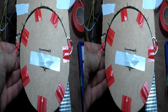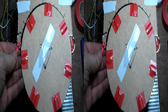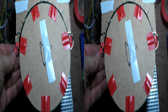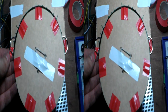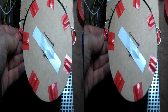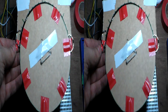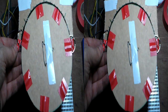You think about it, right? In a standard car, you have a clutch, and that has springs on the clutch, right? And that's basically so that when you use the clutch, it stops the latching of the clutch. It's just kind of a damper between the gearbox and the engine, so that when you connect them, it will take some of the vibration away of the kick. But if you look at that, that's reasonably smooth. If you were actually going forward in a car, it would feel quite smooth. Right, relatively smooth. Okay, this sticks a little bit there because of the video. It is running reasonably smoothly, as you can see.